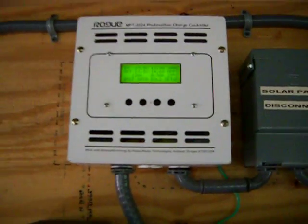So I've got my power that comes in through the cords there. I'll show you this is my junction box — basically my combiner box that I made. The first white and black split off to these ground bars, and then I have another white and black that go back up into that wire and actually go through this conduit here. Down here at the bottom, you can see the power travels through here — the solar panel disconnect into the charge controller to another disconnect, and then that goes to the batteries. Then it goes right from the batteries, and I've got a 100-amp car fuse back here — those work great.